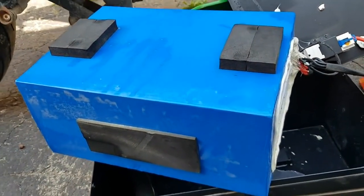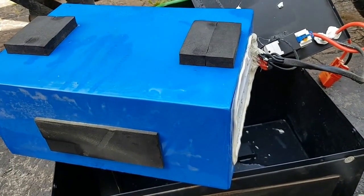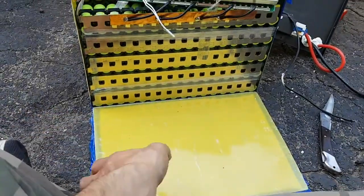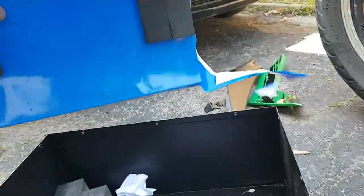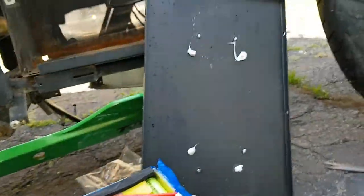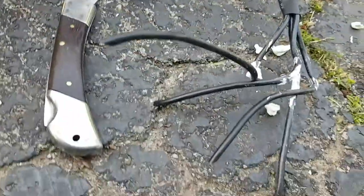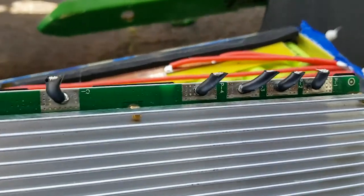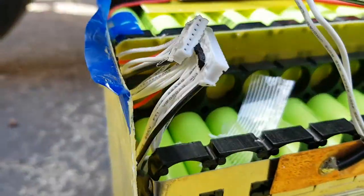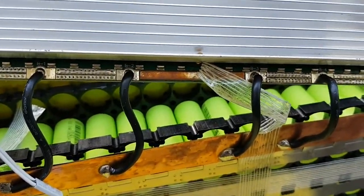I've got the battery out and I'm going to have a look at it, because for all I know the BMS could be wet — let it dry and it could work. If you know enough about electronics you can proceed. Now that I've opened up the box and got all the extra material off, it actually seems dry — it's all dry in here. All these black cords on the inside — there's your charge one — they all go to the same ground. Those are your grounds. Then there's the temperature sensor and the balance wires.